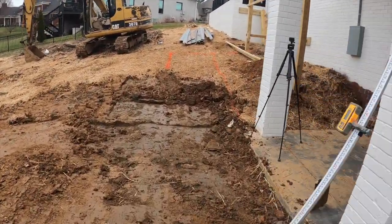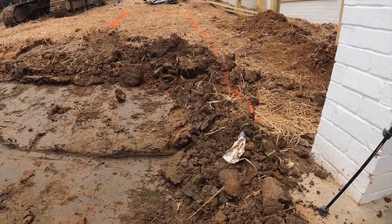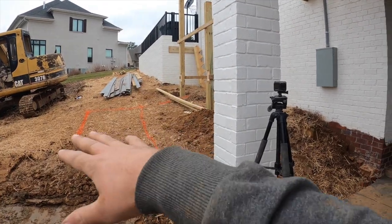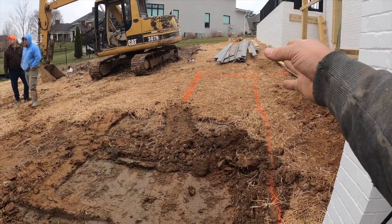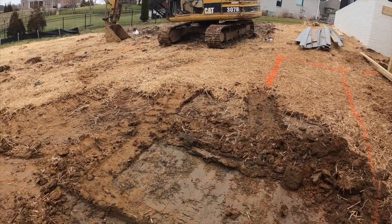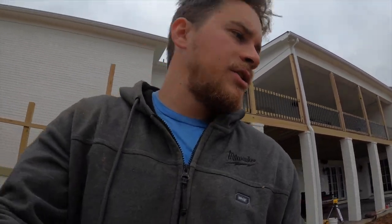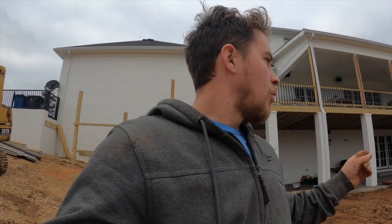Okay. All right, part of the dig here is we're building a retaining wall. It goes way up, so we need to dig. The clients, the homeowners, are building the retaining wall. We're putting our equipment slab over here, so they're going to build a retaining wall there and there, and we're going to put a slab on top. And then it's going to step down. But our dig needs to go back to that line and over there, because that's where the concrete comes out and over. But we've got to get all this cleared out for the wall and landscaping. And that's going to be our transit height. So part of what we're going to do to eliminate a lot of sinking is scrape the rest of it with the excavator, and then come back and grade with the bucket.